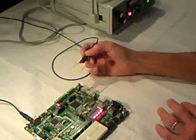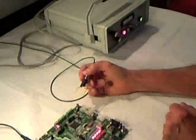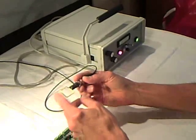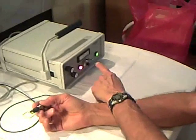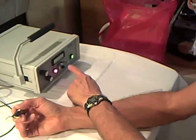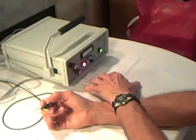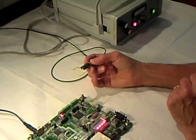I have three items here. I've got a microprocessor development board — you can hear it making its little sound. I've got a wire loop that you can find all over my website, www.dsmith.org, made out of stiff wire. And I've got a Fischer TG-EFT pulse generator set for 250 volts open circuit. It produces a pulse with a fast rise time and a slow fall, and through the mutual inductance of the loop, that generates a single positive or negative pulse in the circuit.